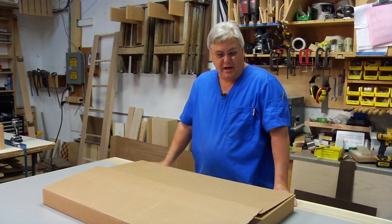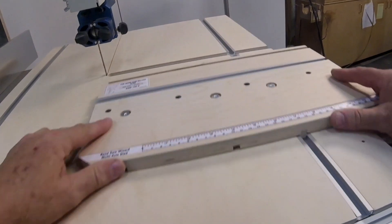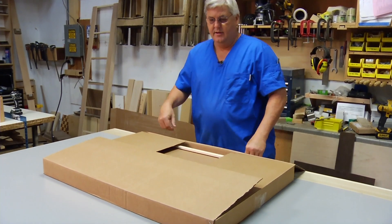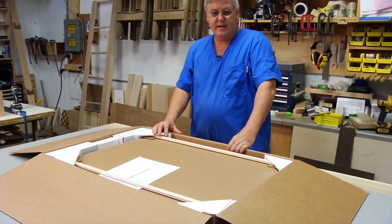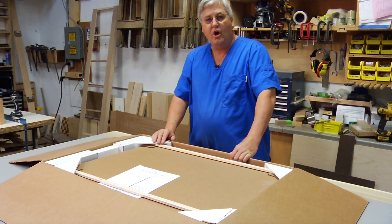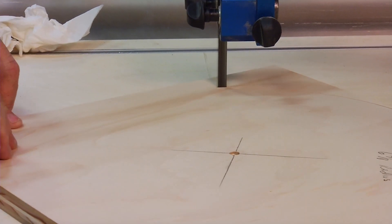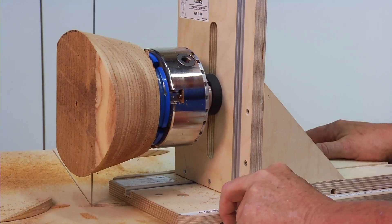Pretty much what we have here in this box is a new table. We slide this onto the existing bandsaw table and adjust it, and now you have a foundation for a lot of other jigs that you could use for anything you can imagine. This is a combination of 40 years of experience on a bandsaw — I always made a specialty jig for this or that, hanging on the wall, and rarely used them again. So what I tried to come up with was a system where you have a nice table you can cut circles on, and other jigs you can apply in T-Tracks to cut odd shape items, because odd shape items are very dangerous to cut without support.